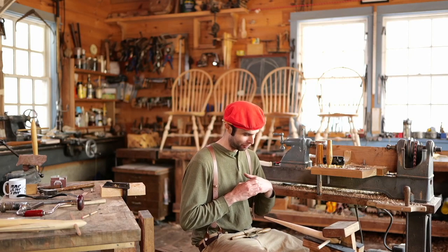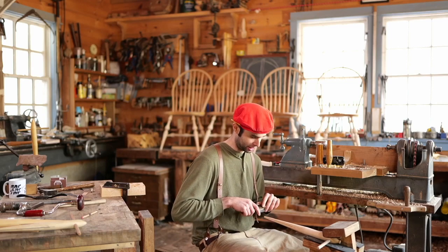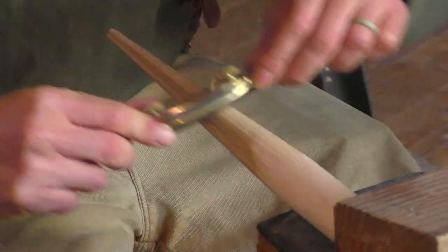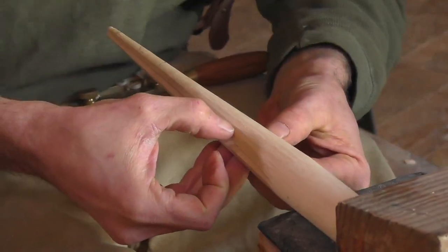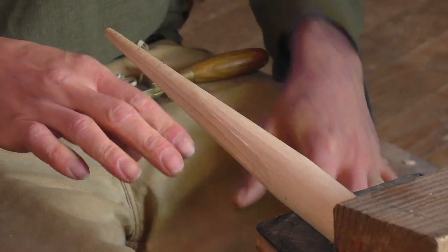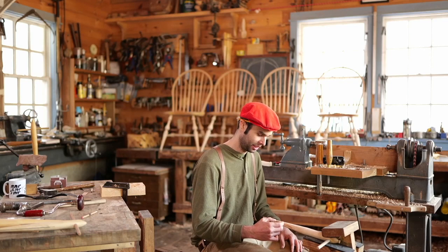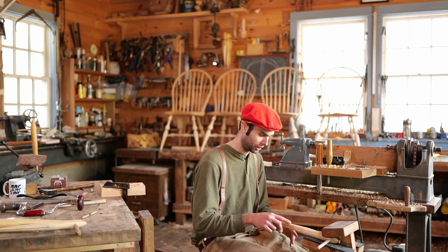But I had fixed reamers many times by doing this. So I don't know what happened in my test, but I'm going to start by spoke shaving wood off of this middle part and leaving the back side. So just like if this is up and down across the thickness of that pine that we're testing, whatever's highest will keep it from cutting. That's also true along the circumference of this piece.